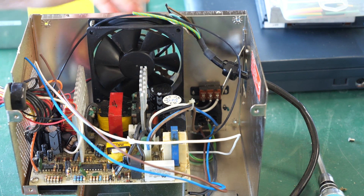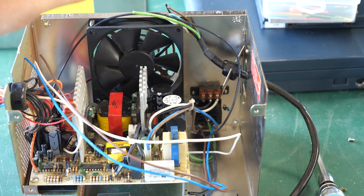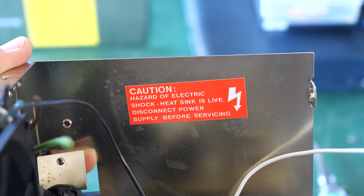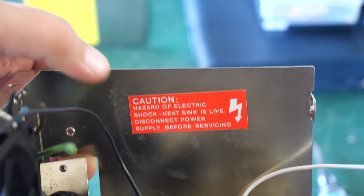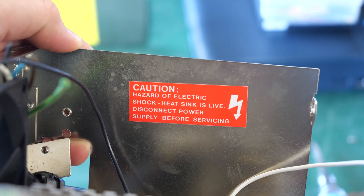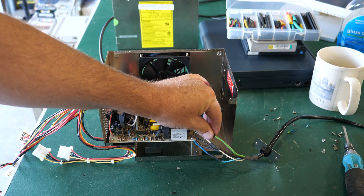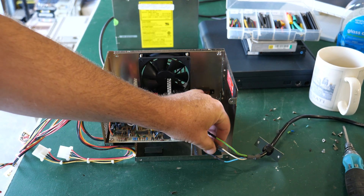So I'm going to go ahead and finish the job here. I've got my shrink wrap here ready to go. I'm going to go get some wire strippers, hook all this up, and then see if I can get this to work because it does look like it's in good shape otherwise. If it does work, it'd be great to have a spare for some of the computers I'm working on. And here's the caution sticker on the inside of the power supply — do heed these caution stickers. Maybe I'll take a closer picture of this and make this my little disclaimer that I put on things when working on CRTs and stuff. Got all the wires connected up. I've trimmed them down, connected them, soldered them together, put heat shrink on them. So these are really strong now and shouldn't short on anything.